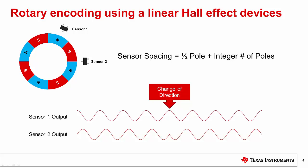This implementation will take more computational power in the system controller, as the analog voltage will first need to be converted to a digital signal; then the microcontroller will perform digital signal processing to determine the speed and direction of rotation.